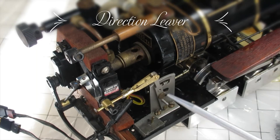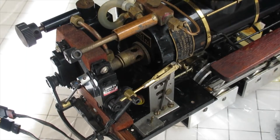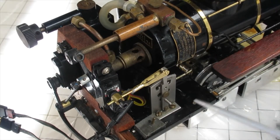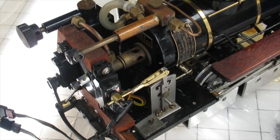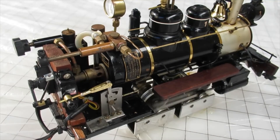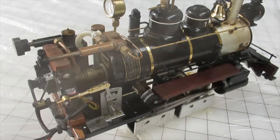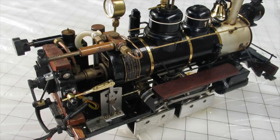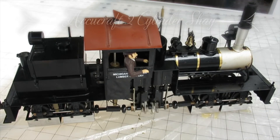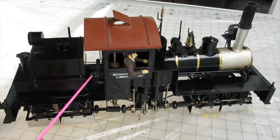The third control is the direction lever, which controls the direction of travel of the locomotive. When the direction lever is in a straight up-and-down position, it blocks steam from either entering or leaving the cylinders, effectively locking the cylinders and acting like a brake. Some live steam operators use a servo on the reversing lever and use that as a throttle — going from no throttle to full throttle. However, it doesn't have much throw, so you don't have much resolution, especially at low speed on a locomotive like the Ruby. The control strategy depends a lot on the locomotive design; this two-cylinder Shay is geared for low speed and high torque and is very easily controlled at low speed with just the reversing lever.